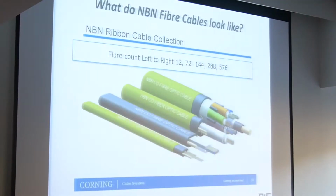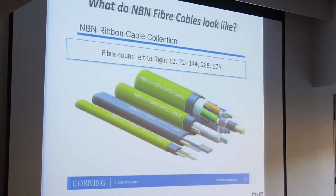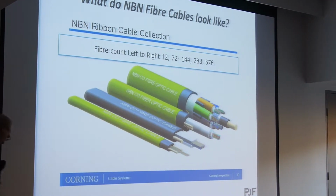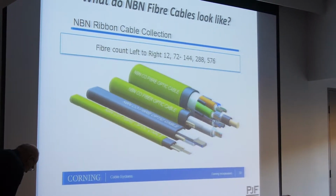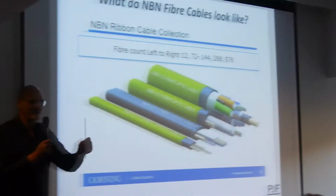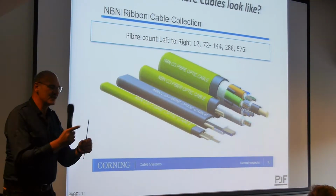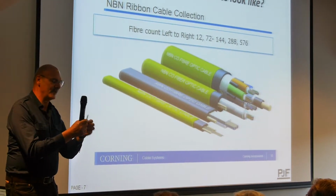Now, one of the most important things about fibre is knowing what it looks like. Over the years, in many presentations, people have a different image in their mind about what a fibre actually is. How big is this thing? So, a fibre that you would have going into your house would be one of these. So that's a single fibre cable, the drop cable that goes into a house. Now, why is it that big? It's that big because there's two Kevlar strength members in there. So if you open it up...